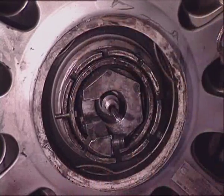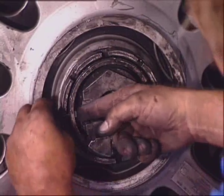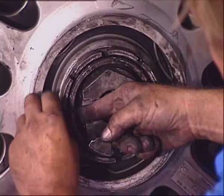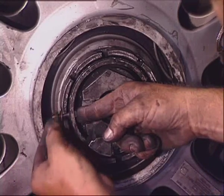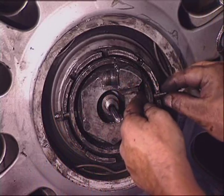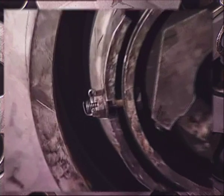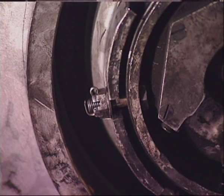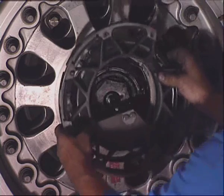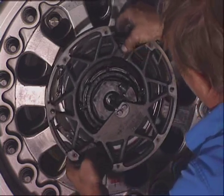Install the locking nuts with the head of the screws facing the axle. Fit the washers and the nuts. Tighten the nut. Safety the locking nuts with split pins. Install the shroud support centered by a centering pin and tighten the V-clamp.